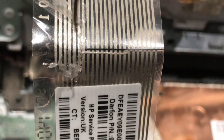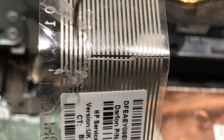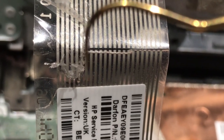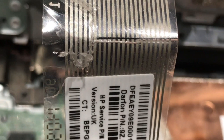What I need to do is to move this down to here where this label is, and then I'm going to test the conductivity of each of these tracks, because one of them — I think it's this one here — is snapped. Then I'll paint that with some conductive glue, and hopefully that will fix the problem.